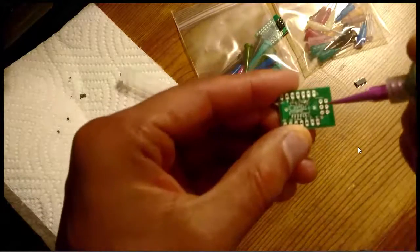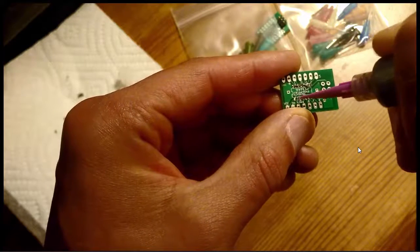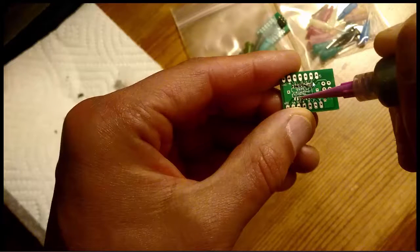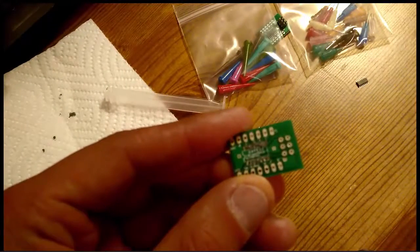I pick up the board, and I purposely smudged the solder paste on a little sloppy. I put a little too much on those first couple pads, and I'm doing that deliberately. You can see I'm not being too neat — I'm just dabbing it where the footprints are, where the metal pads are. I put way too much here as an example. I want to show you how well the solder flows when you heat it up, so you don't have to have it perfect.